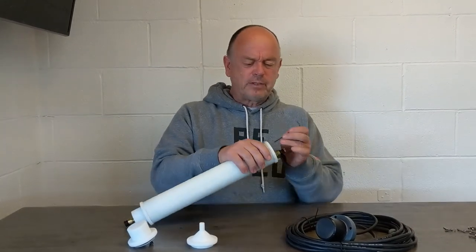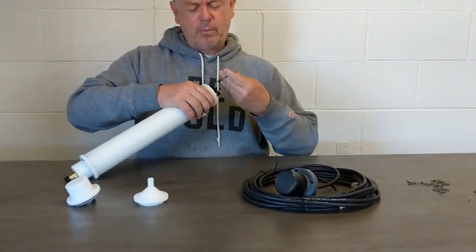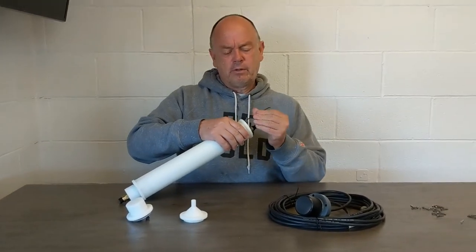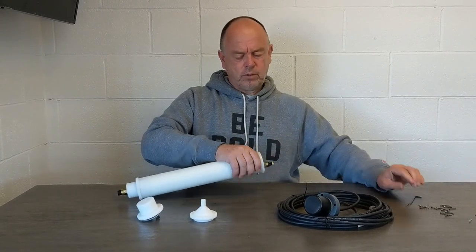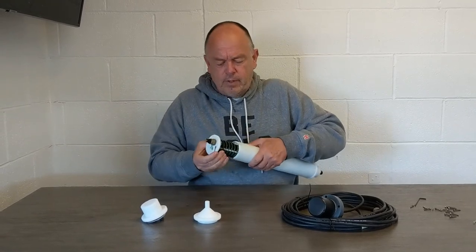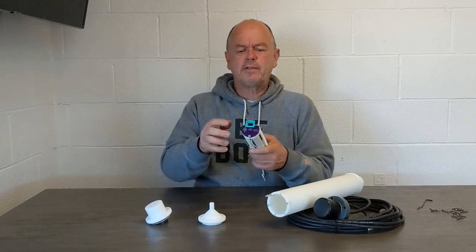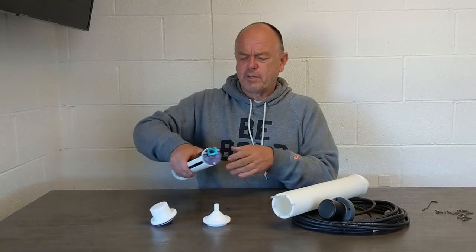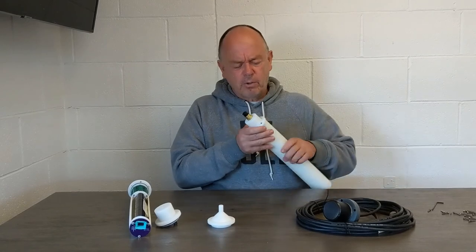You open up the recorder, as you have seen in a previous video. We recommend first on the electronic side. I only have one screw in here. Take that out. And now I can open up the recorder. As I pull out the electronics end cap, you will already see there's a connector at this end, and that mates to your hydrophone assembly. The hydrophone now sits on the other side of the recorder.